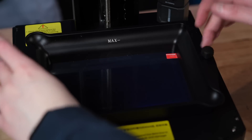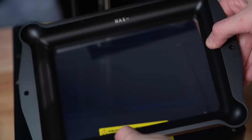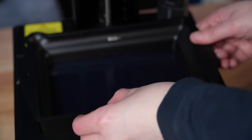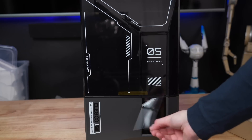The vat and screen are always packaged with screen protectors, so make sure you remove both of those before you go to print anything. The vat itself has also been slightly redesigned and now features pour areas on two corners. This printer also has a smart sensor that can detect resin shortage and foreign objects — so basically, if the print starts sticking to the FEP sheet and not the model itself, it can detect that.